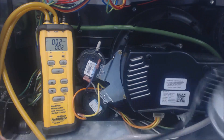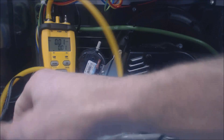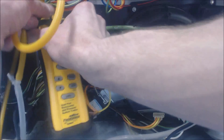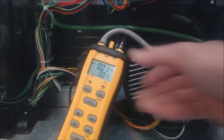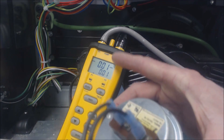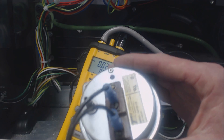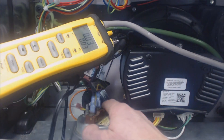If we turn this pump off and take this tube off, we can disconnect the pump and use just one hose right here — attach it to the inducer motor basically where the hose connects into the pressure switch, or take it off completely and just use that hose. If the negative pressure from the inducer motor is higher than the switch's set point — for example, if the switch closes contacts at 0.5 and the inducer motor is pulling 1.0 inch water column negative — then we know the pressure switch is good. It's opening and closing on the contacts and the inducer motor is pulling a significantly higher negative value.